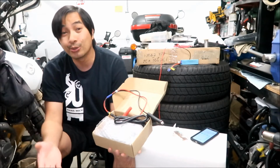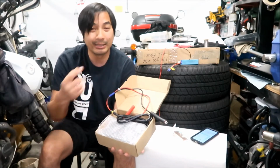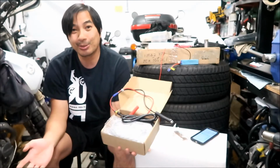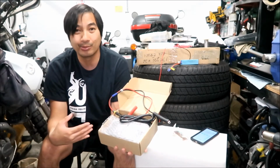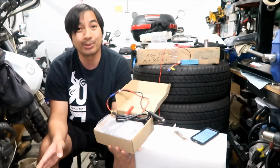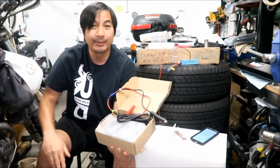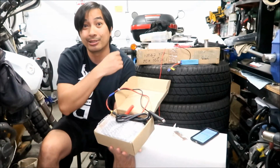Another thing we could do is take the other battery out and plug this one in, and then let the solar charge controller charge the batteries. So there's a couple things we could do, but I'm thinking let's just build the pack first, and then we'll just charge it, and then I'll top balance it. And then the important thing is, when we get it hooked up, to run through all the power, run it dry, and then do a bottom balance. And while I'm at it, I can bottom balance the other battery too.